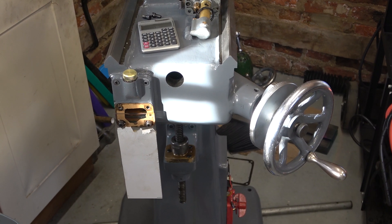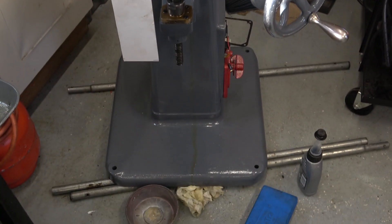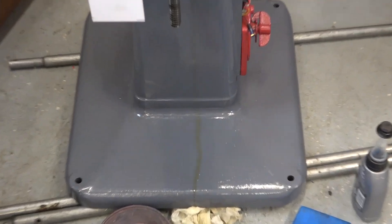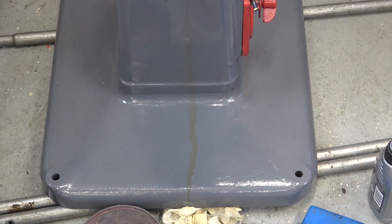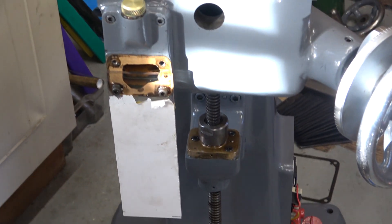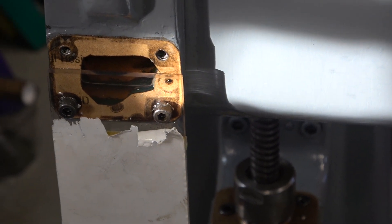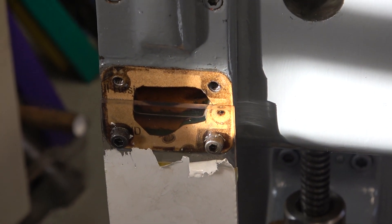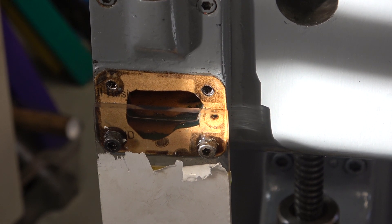We come back about four or five days later. Put your hand up if you think I'm wasting my time. You can put your hand down now — dribble dribble, look. There's no way the oil can get to the delivery pipe inside because it's too high up, so this must be coming from a leak somewhere in there. Because we know it drained completely — when I got the machine there was absolutely no oil in there — we know it must be a pinhole or a crack somewhere very low down in that oil reservoir. So I'll drain it out and see what we can see inside.